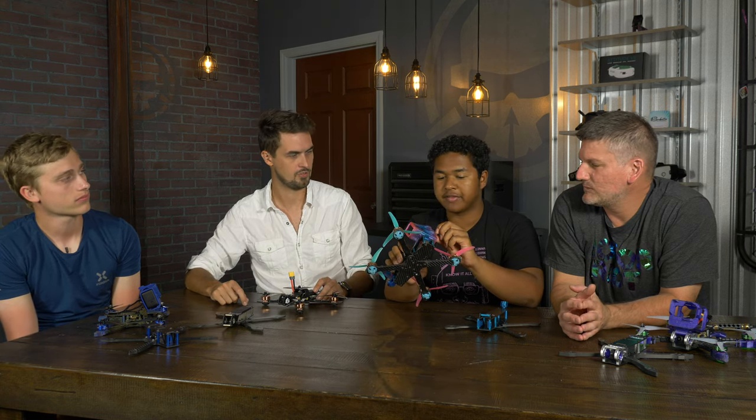Even though I think you have kind of crossed a line where there's not as much weave as I'd like, you've just got so many layers, and a lot of resin in there. So the proof is in the pudding. We literally slammed this in the ground full send 3 times in a row and still didn't break an arm. It broke right there, and since then, by the way, I've got a new bottom plate that addresses that issue. So it's still not going to break in that crash now today. At least not there.